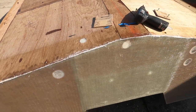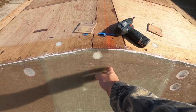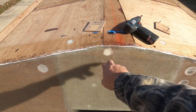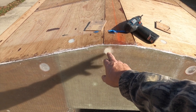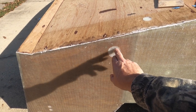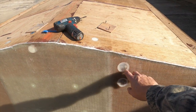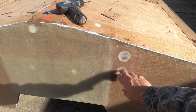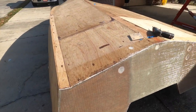It doesn't stick to it — packing tape works out real good. You can see the garboard drain plug is off center because it's got that center stringer running right through there. So I just put a limber hole in — I'll drill that out. This has a drill schedule with an offset so it fits nice and tight. These will be the inch-and-a-half drains. When I drill this out it'll be just on the outside of where that wood is, so there'll be a full epoxy layer there. Then the motor mounts, obviously the stern eyes — but overall the hull looks pretty good.